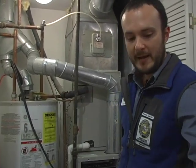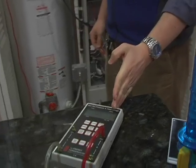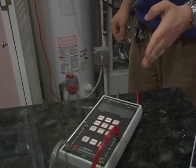Now we need to take our draft reading, which at this point is negative 2.9. Based on the temperature outside — it's 40 degrees outside — I would use my BPI standardized draft limit calculation, which is 40 degrees divided by 40, which is 1, minus 2.75, which gives us a draft limit of negative 1.75. We exceed that right now, so we've passed this without the furnace running.